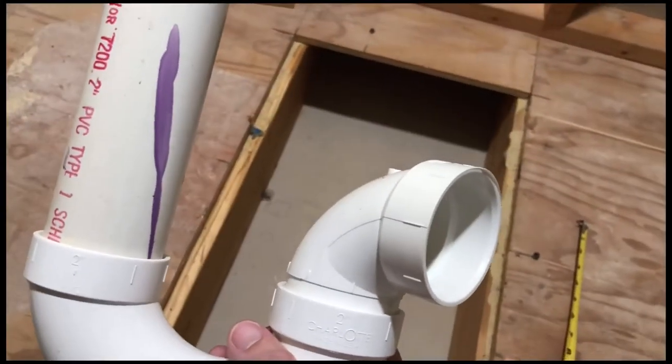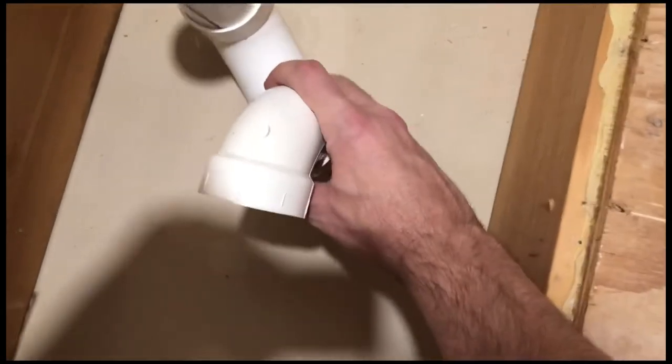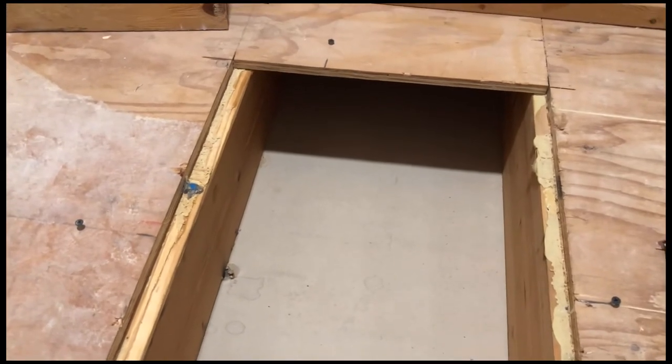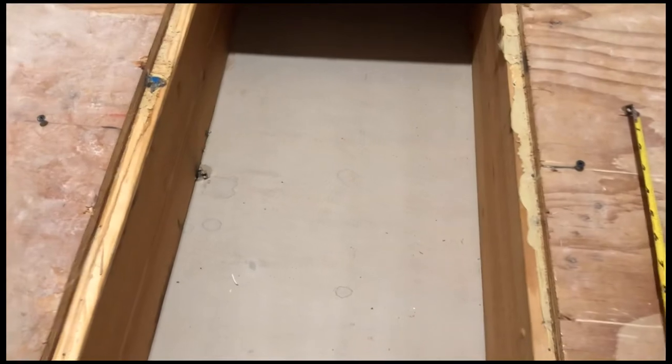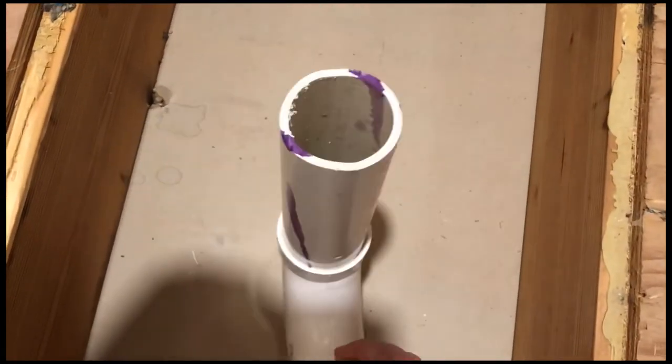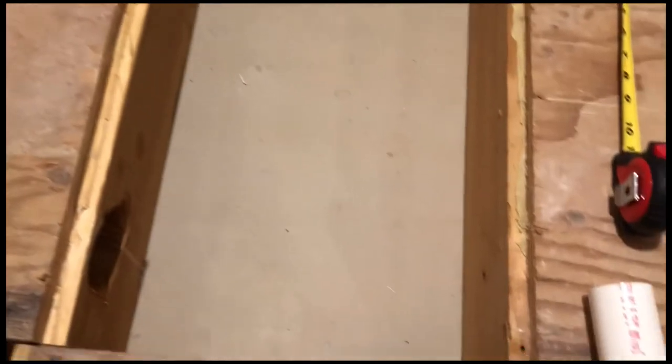And then my shower drain - I put this together here. The drain will be this top part. I'm going to go through the trap and tie into the 2-inch line, sitting just like this and tying straight into the line there. I'm going to do the same thing where I've got to put some screws in that will give me the center point for the drain - this one has to be pretty exact, and the shower pan is already built. I'll run my strings across there, and the good thing is I can adjust how far this moves back and forth with this straight piece in between. And since this is a trap, you can spin it and turn it any way you want to get it centered. I've got these pieces glued in.